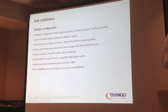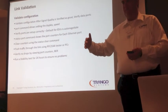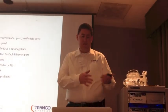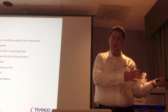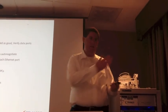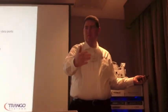We buffer them. But the first packet in the sequence comes in with no delay, and the last packet in the sequence comes in, you know, 10 seconds later, potentially. Ridiculously long time because we get these big buffers. Now imagine you filled up this buffer and now you get this high priority packet that you really don't want to drop, a UDP packet coming from your VoIP phone. Well, if you didn't have any kind of quality of service, that UDP packet would be stuck at the back of that buffer. And in my extreme example, if you had 10 seconds of buffering, you'd wait 10 seconds before you got that packet.